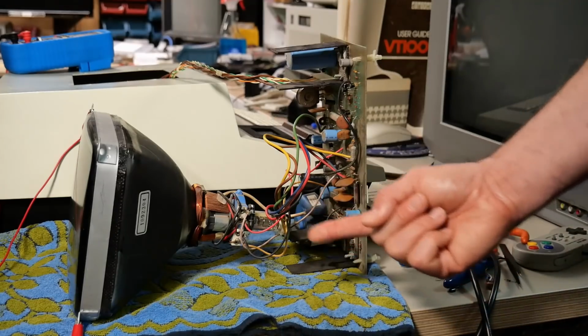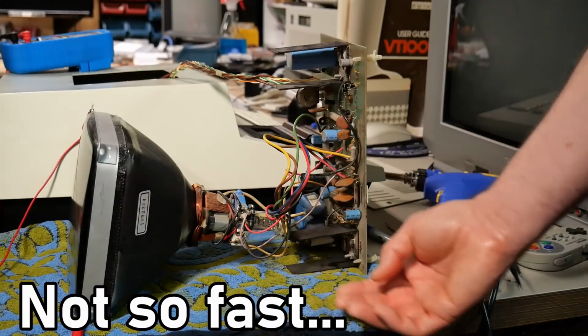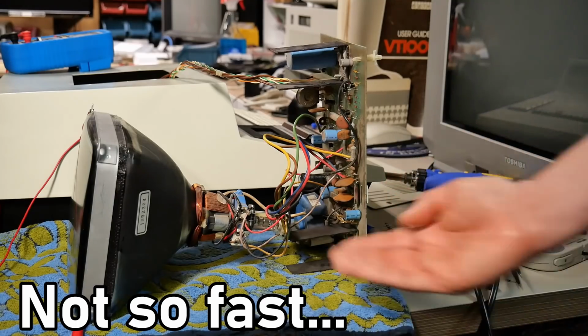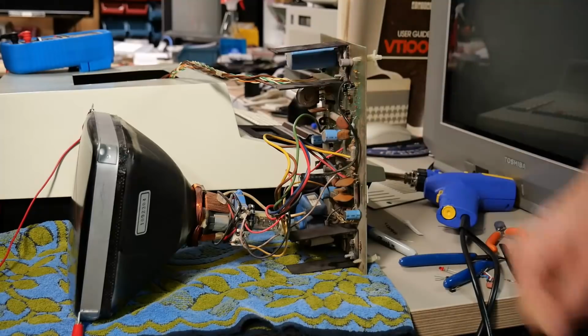So I think that pretty much clinches it that it's the CRT in the PET that has a fault now that's causing that spot. There were multiple problems, right? There was the original problem on the board causing the spot, but now we have some slight leakage in the CRT, and that this CRT has no issue.